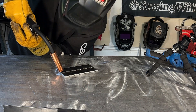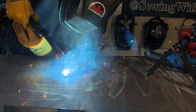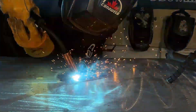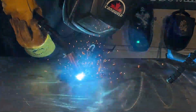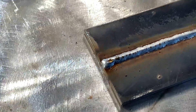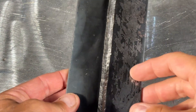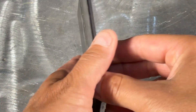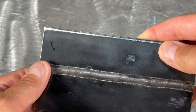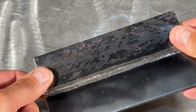For thin plate, keep a slight push angle around 10 to 15 degrees and keep the wire at the leading edge of the puddle. You want a steady travel speed — watch the puddle bite the top edge of the bevel on each side. A nice, crisp, clean short circuit sound tells you that you're dialed in just right. Looking at our finished product, we welded both sides of the joint. One side we pushed the puddle, the other we dragged it. Where we dragged the puddle, we're slightly higher and more crowned up, whereas where we pushed, we've got a slightly flatter weld.